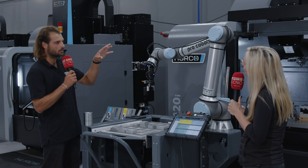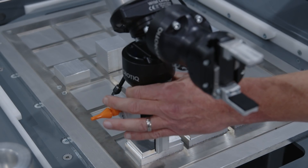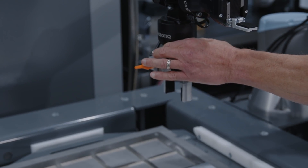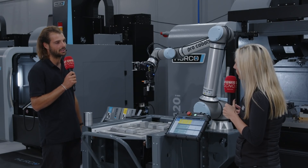Some people would say these are easier than industrial robots. With industrial robots you need to teach each point they need to go to — picking up a part and putting it in your vise. With co-bots, you can tell them where to pick up the part and where to put it in the vise by literally grabbing the robot and dragging it round the path that you want it to take, which makes setup so much easier and simpler.